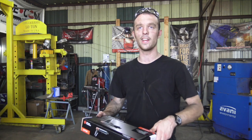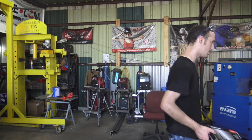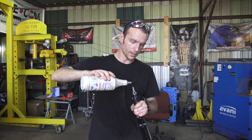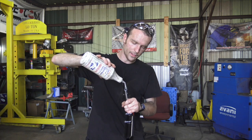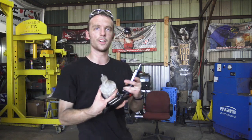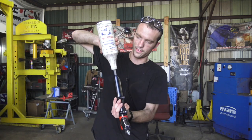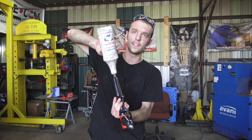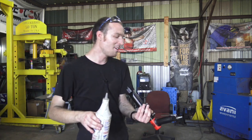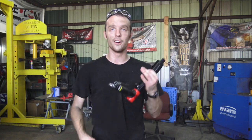So I've never used one of these before. I'm told it's deafening and will vibrate the crap out of your hands — this is going to be way longer than 30 seconds. So I'm going to put on some gloves, put on some hearing protection. Like any air tool, it's very important that we oil the crap out of this thing beforehand. I like this Lucas Oil stuff. Generally, on the inside of a tool like this, you build up a protective slurry of oil, and obviously a new tool won't have that, so I'm going to try to oil it every couple minutes when I first use it. Somebody told me to dump some oil down the front the first time. When you over-oil something, it just shoots the extra oil out — when you under-oil stuff, it gets destroyed. Therefore, I try to over-oil things instead.